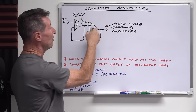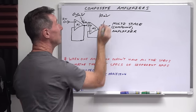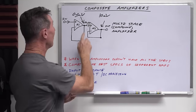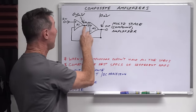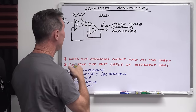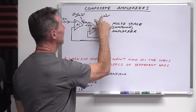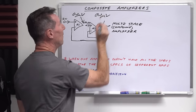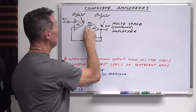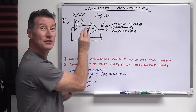You've added that 10 millivolts horrible offset, so your output is 10 millivolts. You've just destroyed the advantage of using the ultra-low offset here — you may as well not even bother. But if you connect the feedback from the output of the buffer like this, your output then becomes 0.1 microvolts, not millivolts. And you've essentially gotten rid of that offset voltage.